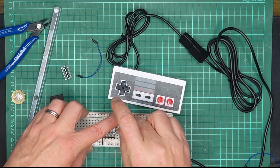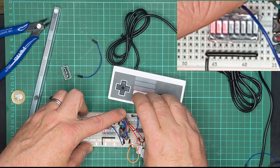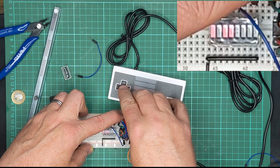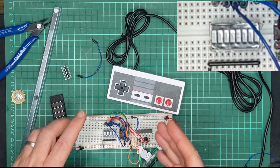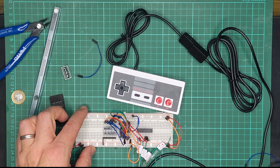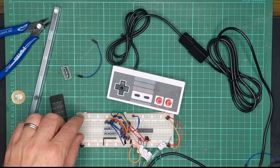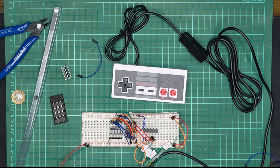It may be difficult to see under this light, but as I touch the buttons — in fact, as I hold down more buttons, more lights come on. Each of those lights corresponds with a bit for the button that's being pressed. See, that's not so hard. Now I'll add another shift register and probably put another display on it because blinking lights are nice. Then I'll have a go at integrating this into Spam1 as another module, and I'll come back and see whether Tetris is actually more interesting. Well, that's that for now — I hope that was interesting.